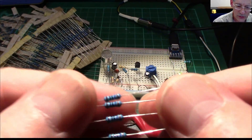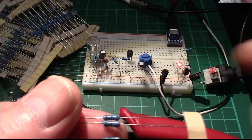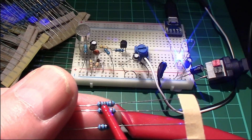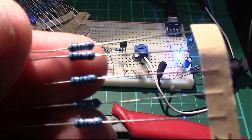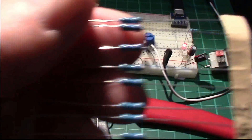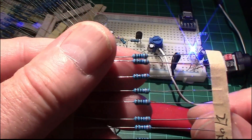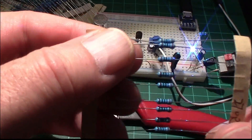What does that mean? It means this is not a four-band resistor — it's a five-band resistor. And I'm as lost as the next person when it comes to five-band resistor codes. I was under the impression they'd introduced a five-band code to cater for tighter tolerances and then abandoned it because nobody could get hold of them. Well, it looks like they're back in force.